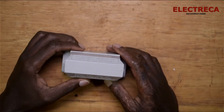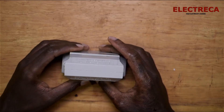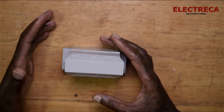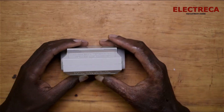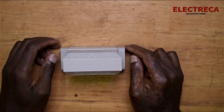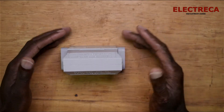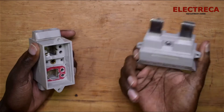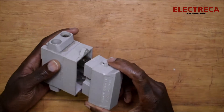This is a cartridge fuse, best known as a cutout. It's called a cutout because utility companies use it to protect your whole installation, but also it makes it easy for them to cut power from you without removing a cable from the pole. They simply remove this fuse, and when you settle your dues they will just put it back.